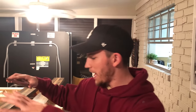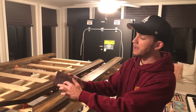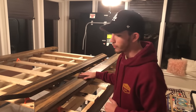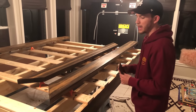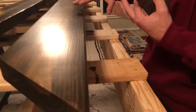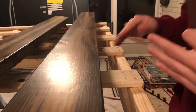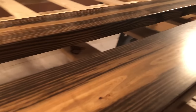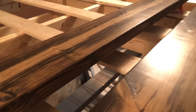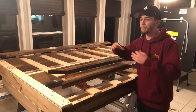It's the end of the day and our two-by-sixes are completely finished — three coats of water-based polyurethane with a 3M finishing pad in between each coat. We also gave it a once-over after the third coat. This thing looks absolutely incredible. We did a satin finish and it brings out the grain beautifully — you can see the darker areas where the sapwood reacted with the stain and the lighter areas where the heartwood interacted. Now that these are dry and ready, we've got to bring the frame into the bedroom, put the mattress on, and finish up.